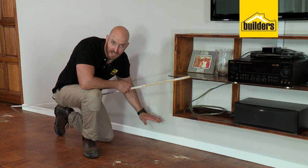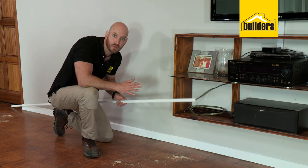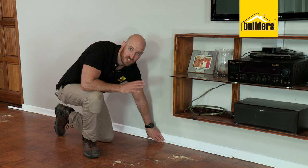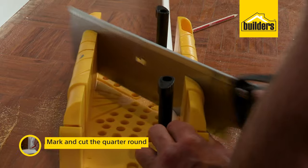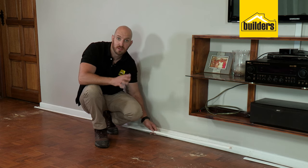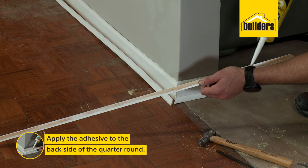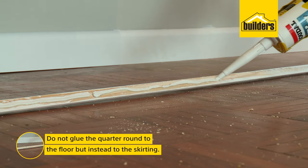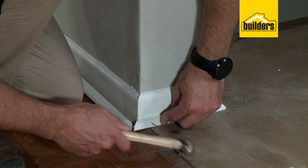The skirting is in and looking great, but because of the level of the floor there are some gaps and imperfections — this is where the quarter round comes into its own. As you can see, placing it there disguises and hides all those imperfections and gaps and finishes it off perfectly. We can now mark up and cut our quarter round in the exact same way we did the skirting boards. Once it's all cut and dry-fitted, secure it to the skirting using a bit of adhesive and some panel pins. Remember — we're not sticking it to the floor. The floor, especially being wood, will shift a bit and cause cracks, so we want it free-floating and only secured to the wall.